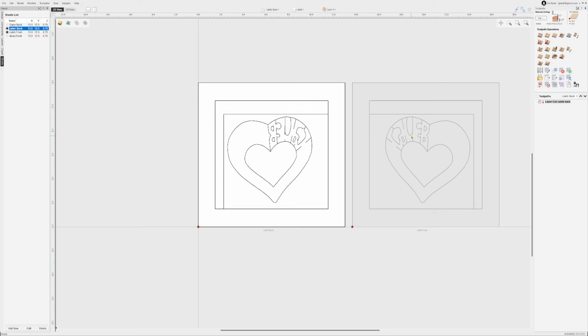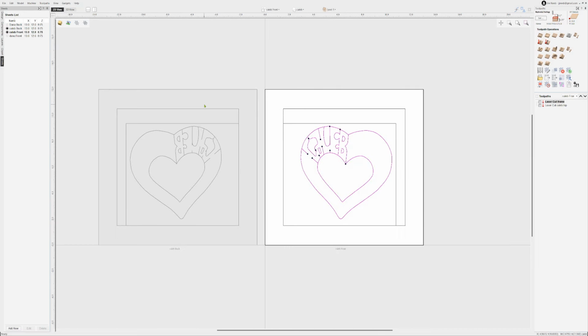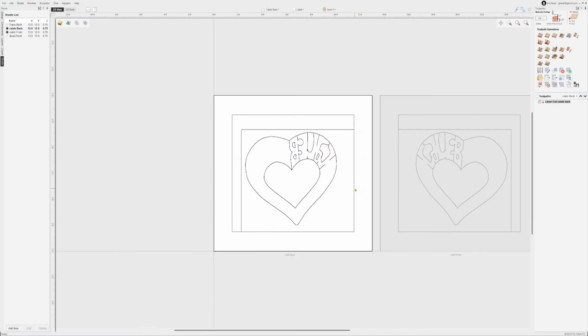You can see basically I've created two single-sided sheets, but the external frame is a direct copy over, keeping the same orientation, and the material boundary and the project itself are copied over and then flipped over as a mirror image and shifted to the right. And so what you can see is that keeps the left side of this material bumped up against this left side. And then when I flip it over, this edge on the right is the same as this edge. So as long as I keep this project itself and the material boundary grouped and properly aligned on the left side for the front, and then over here on the right for the back side, I've essentially created a perfect reference for this frame that I'm going to cut out with the laser, and then the wood that I'm going to cut out with the laser within the design.